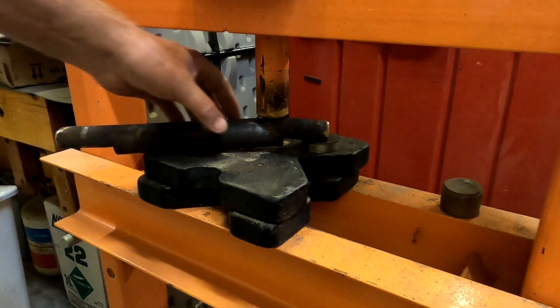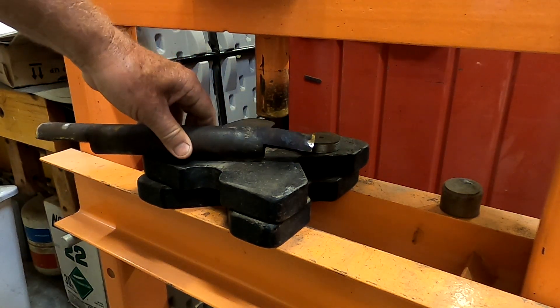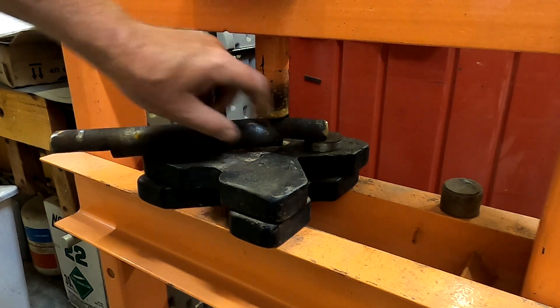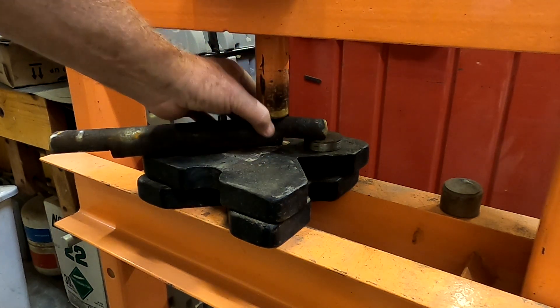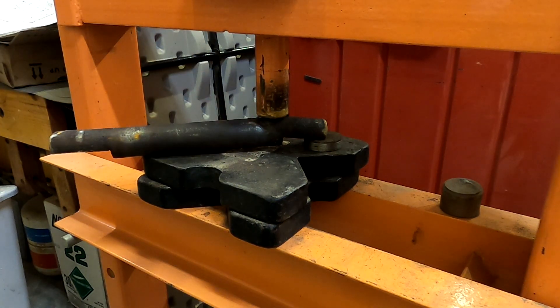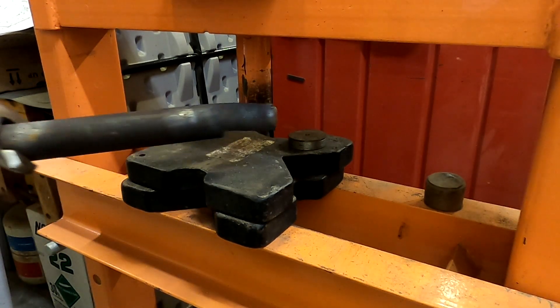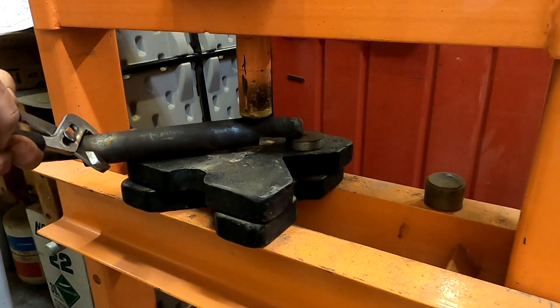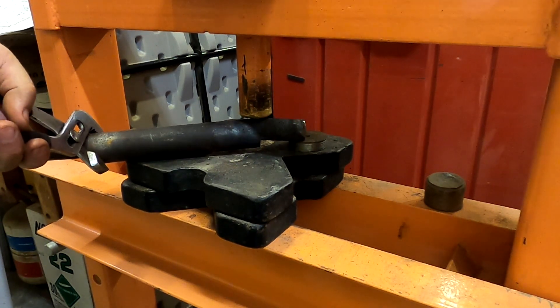I have this pin here for the house lock and as you can see it's bent up a little bit. What I want to do is get a little spacer here to space it up and take the press to push down right in this area to straighten it. First I'll take it out and heat it up a little bit to make it easier to bend. I have this part heated up good and I'm ready to put it in the press, getting it laying in the right direction.